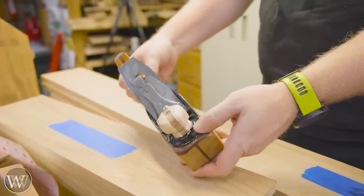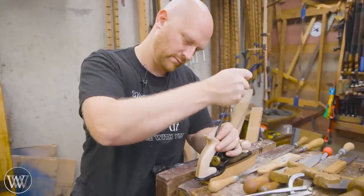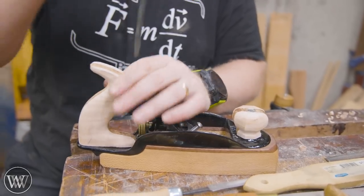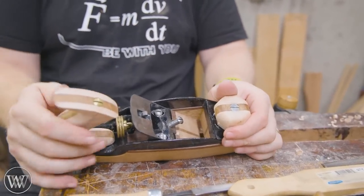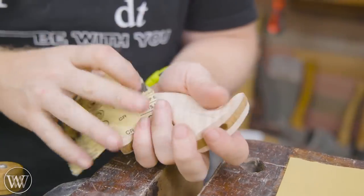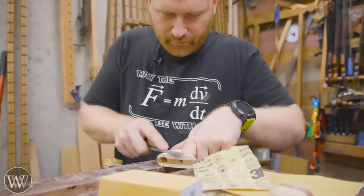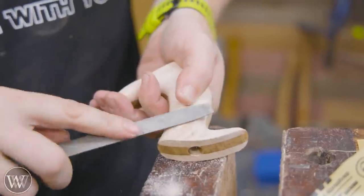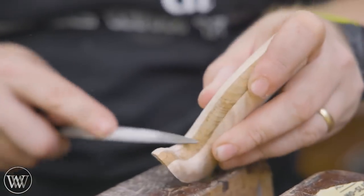Once they're down close to the line I can come in with the file for the last little bit, taking it right up to the line and making it sweet. After this it's all about fit and finish — making it feel nice. I go over everything one more time with the finest file, smoothing any last lines and marks. I'm using a 400-grit sanding block that fills in the pores and bits left from filing, then coming back in with the finest file to clean those out. The sanding block shows me where I need to detail, but the last thing touching it will be the finest file.